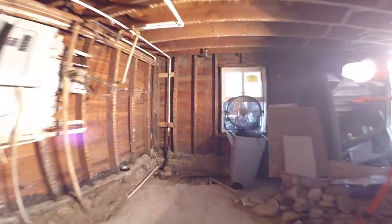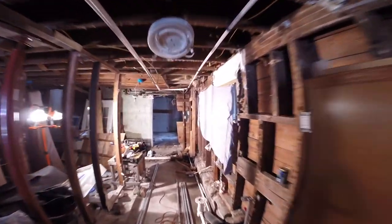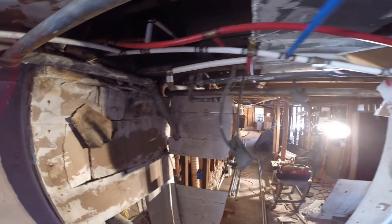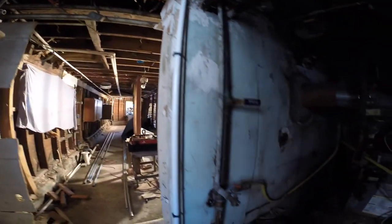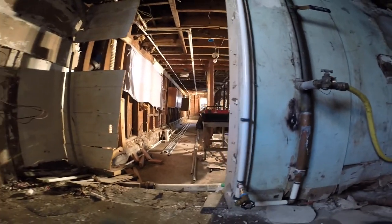All right, here's a recap. Took the main, stuck it up the wall, as you see, rounded across the ceiling, back to the heater room, to where the old water main was, and turn the water on. You saw that. Came across this header, which is not even gonna be a doorway no more. So we got temporary water, and tomorrow we start the gas. I'm not a fan of PEX, but it's done.